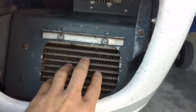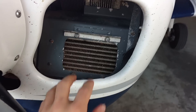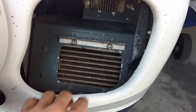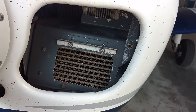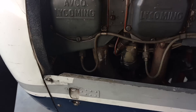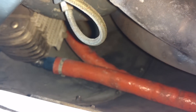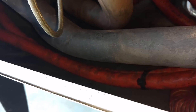On the front side here we have our oil cooler. That's responsible for taking in cool air from out in front of the engine and keeping the oil cool. So the engine is not just air-cooled — it's also oil-cooled. It relies on cool oil to take the heat away from the metal parts inside the engine. Coming around the back side, we look at our oil cooler and notice two orange hoses coming off of it — those are oil cooler lines.